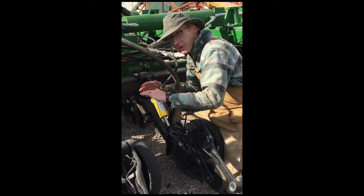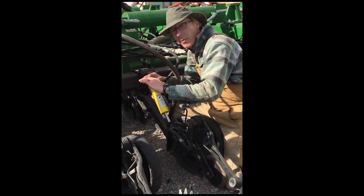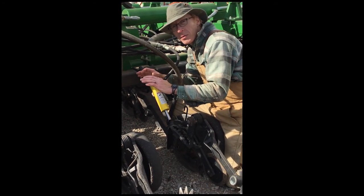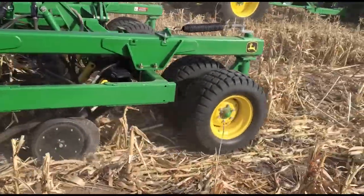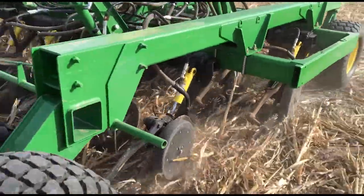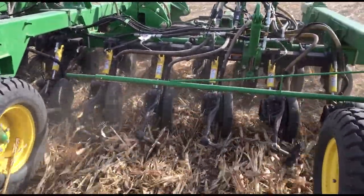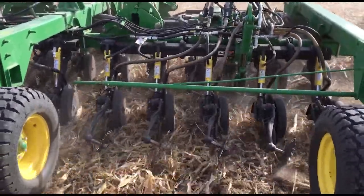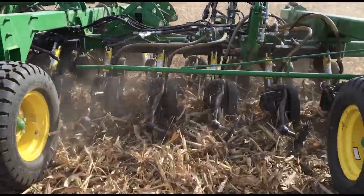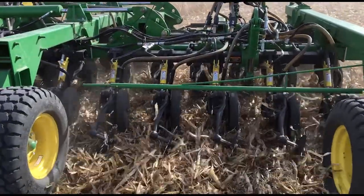But because so many of those openers are down in little depressions, everyone cranks the pressure up, trying to get the last 25% of the openers to work halfway decent, and meanwhile, the other half or so of the openers are way over compressed. Here we get uniform pressure on every opener throughout the range of stroke. We also have more range of stroke than the original spring did. Not only do we have effective pressure all the way to the end where the spring was rapidly decreasing, but we've given them about an inch more downstroke, plus we've got far more upstroke than the spring had. The result is very little stress and completely uniform pressure on all openers all the time.